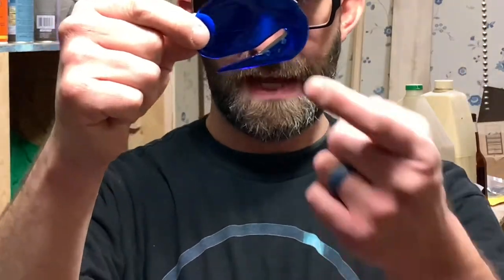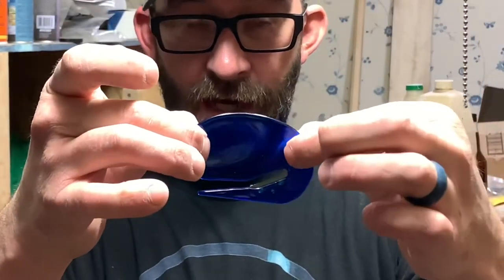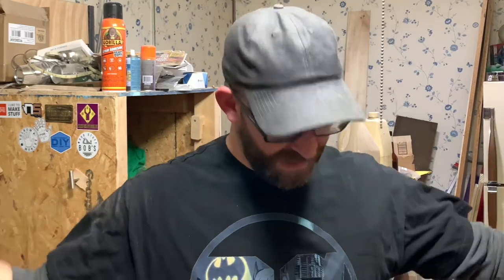So while the track glues up, we need to start working on the paper cutter. Now there's multiple ways you do this. I decided I'm gonna use a letter opener and not one of the blade swordy types. We're gonna use this kind. It has a small little blade right here and a place for it to feed in. I think if we take a Forstner bit, drill two quarter inch holes through this, should be able to slide this right over the nuts, and this should be able to cut the paper. So that's the plan. Let's try putting it in practice.